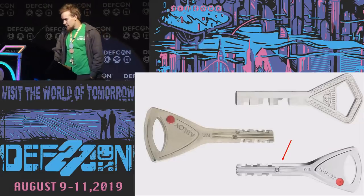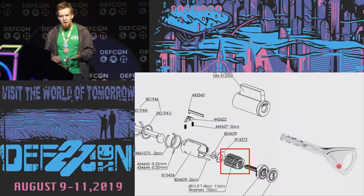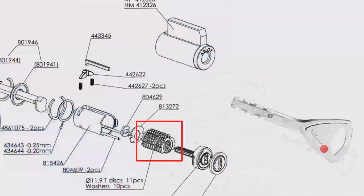How these work is we've already covered a lot of pin tumbler, where you have a lock with pins in it, and the key will raise those to the right height, similar to how you would have a shear line for that. Instead here we have disks. When the key is inserted into the lock, it's going to go inside of that disk stack, which is in the red rectangle. When you rotate it, depending on the notches in the side of the key, it's going to rotate those disks different amounts. And if they are rotated correctly, then the key will be able to open.